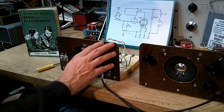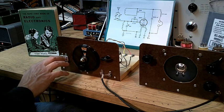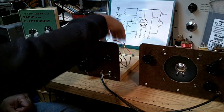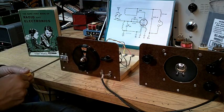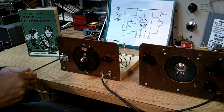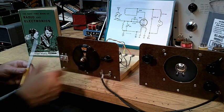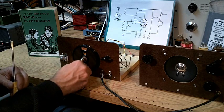The receiver is quite sensitive. If I go near the trimmers, it completely untunes. Go near anything on the other side — of course, it's very sensitive. If I need to adjust the receiver, for instance if we have to adjust the trimmers, just touching it with a screwdriver is very difficult. So the receiver is a little bit difficult to use.